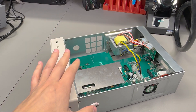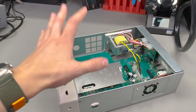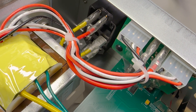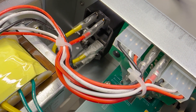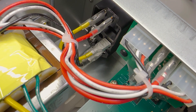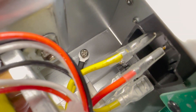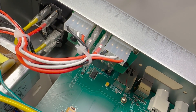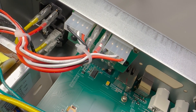It is a very similar construction to the PSU model - now we're in and ready to identify what's going on in here. Let's start by looking at the mains IEC input, which has a switch and fuse. The wiring looks to be top quality here - it's nicely isolated on the metal spade crimps with rubber boots. Down there there's a proper earth connection going down to the metal chassis. This is the input voltage switch module, also very nicely isolated.